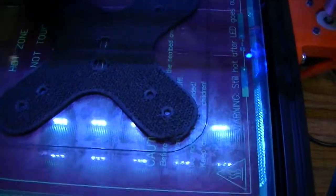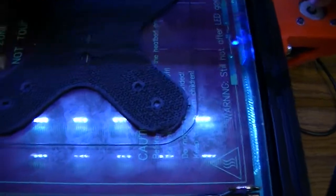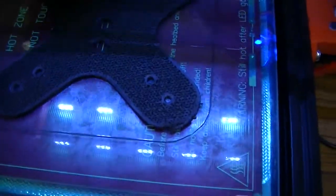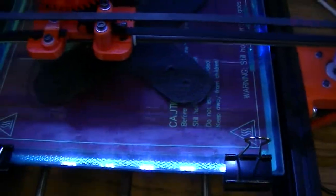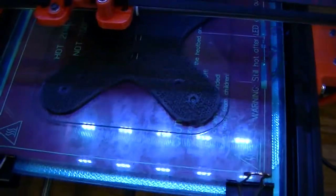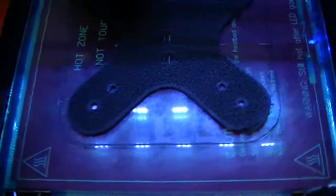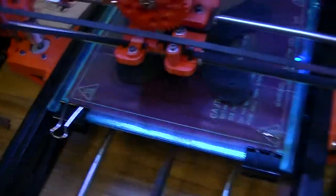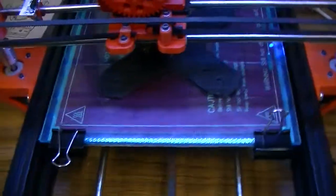I have a little bit of an issue with a corner trying to lift right there. Saw some suggestions about putting little aprons tagging off the corner, or little discs coming off of it, something to increase the area on the bed right at the corner. I'm thinking 3 apron shaped tabs coming off, one from the center and two of them off at an angle coming off of each corner to help adhere the end of that X to the bed.